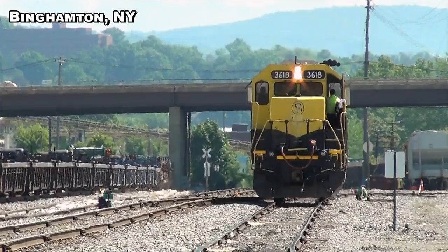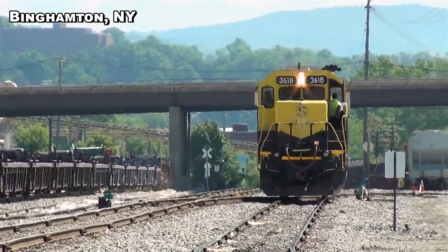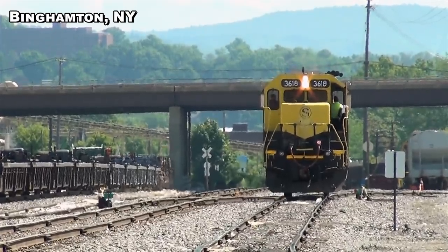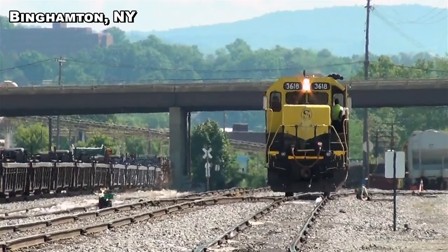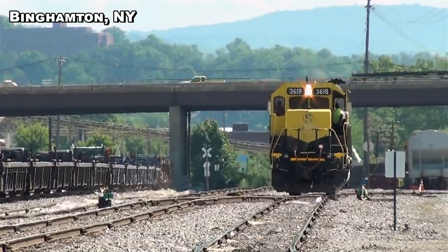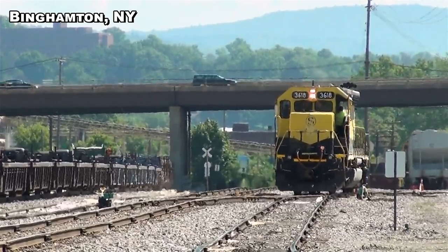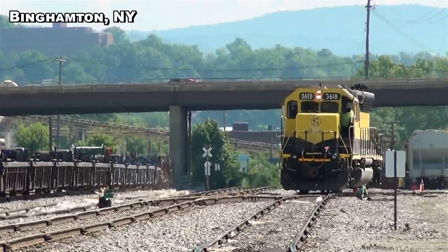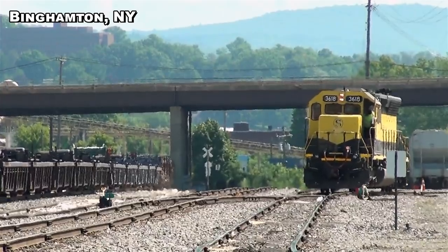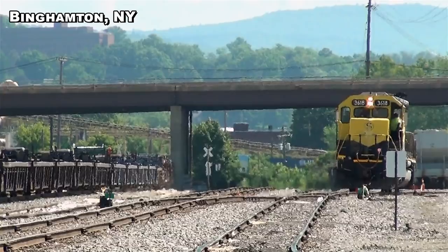The SD45 and the -2 was actually more fuel efficient than the SD40 and the -2 in terms of horsepower per pound of fuel burned. But they produce not an ounce more tractive effort at max cruising speed. So if you power just to make the ruling grade, you wind up with more horsepower per ton with the SD45s, which reduces your train's fuel economy in terms of ton miles per gallon. What this means is that you may be making horsepower hours a little bit cheaper, but you're spending them a little bit faster. Are you confused yet?